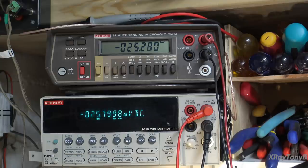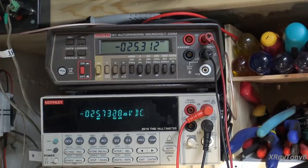That's the problem. If your bias is turned way up, a lot of times you can't hear the difference in the amplifier. The amp sounds fine, but it's going to run red hot. And the difference between a cool running amp and a hot running amp is having the bias properly set. But if you go too low with it, then you start seeing that crossover distortion because the transistors are actually turning off in between the cycle, you know, the zero crossing point. So it's kind of a balancing act, but follow the instructions and you can't go wrong. So there we go. This amp's ready to test, I think.